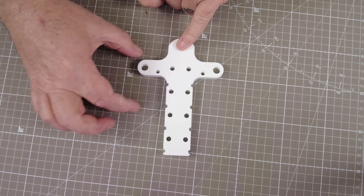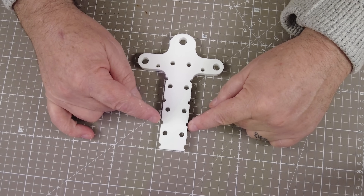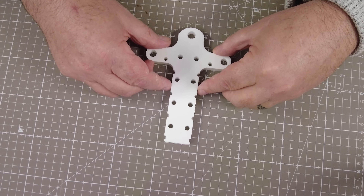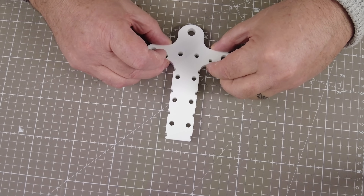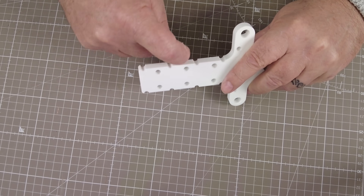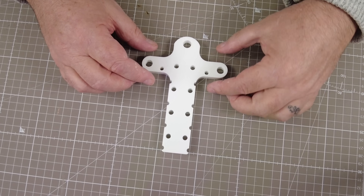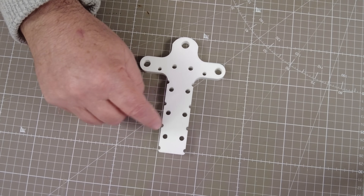I think I just wanted a little bit of separation up here. These little notches down the side are cut just so that cable ties don't slip off. And then if you did have a doublet center using 450 ohm ladder line, you can thread it so it goes up there and down there and it never falls off. It's all in the design.